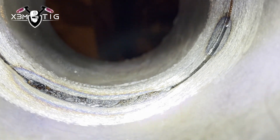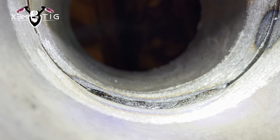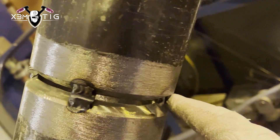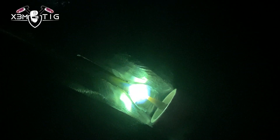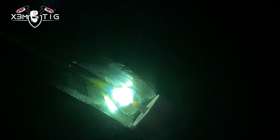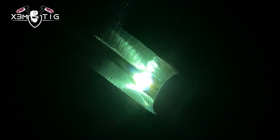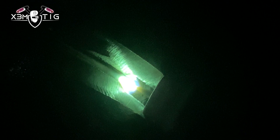The whole idea is you should have only one stop on your root. Go close to that bridge tack, take it out, and continue on. Go all the way close to 12 o'clock, maintaining that rod inside the puddle and stretching that puddle. Watch your travel speed and adjust your amperage — I'm at 126, but you can go lower. On the top portion of the pipe you can drop down to 110 amps just to prevent sag due to gravity. The whole idea of the root is a nice, consistent, uniform root with a maximum of one stop.